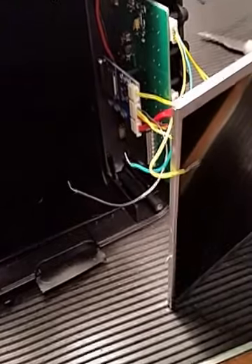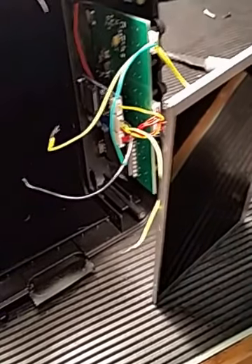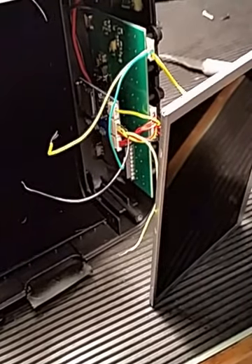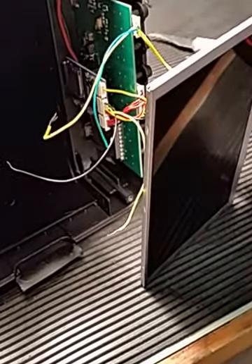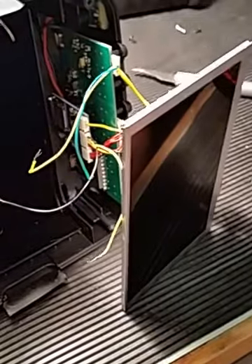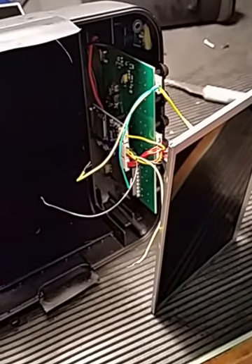Eureka! I wanted to upload this for everybody. I'm going to wire these down to a jack so the signal goes to the jack and into the DVR board — that way I'll have headphone capabilities and the VRD2s can record sound, which I can presumably turn on or off in software. I find it odd that the software had the option to turn it on or off but it wasn't physically wired. I guess that's what you get with budget brand goggles, but for the money I'm still okay with it. If I can fix it, I'm good. Thanks and happy flying — hope this helps.